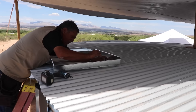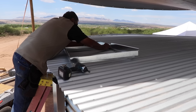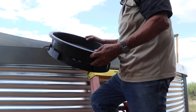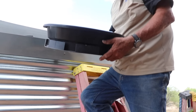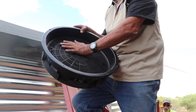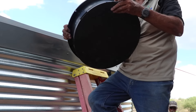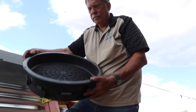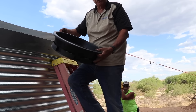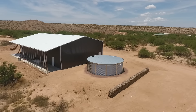That's pretty much the entire tank installation. There's also an access hatch so if I ever need to get inside for cleaning or maintenance, I have that option. The basket strainer that comes with Aquamate tanks is unique — they're the only one I know of in the industry with a baffle on the bottom, so sunlight doesn't come through the open basket strainer and create algae. Water goes through the fine mesh metal screen, drops onto the baffle, flows out through cracks all the way around, and drops into the tank. Here's the final tank install — looks fantastic, I love it.